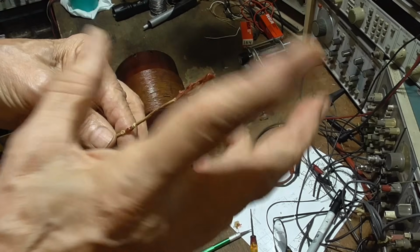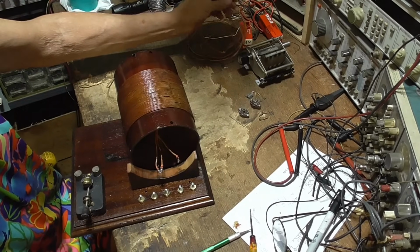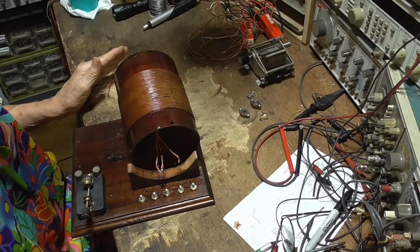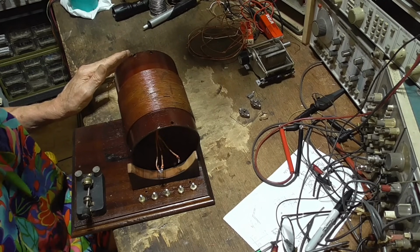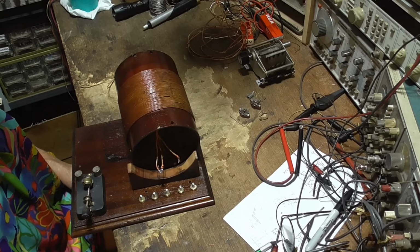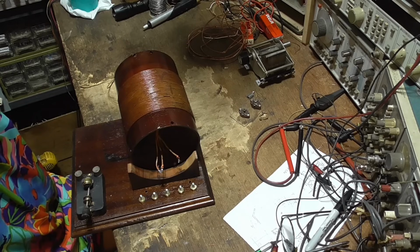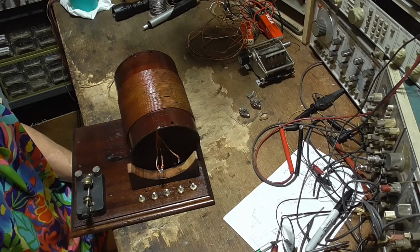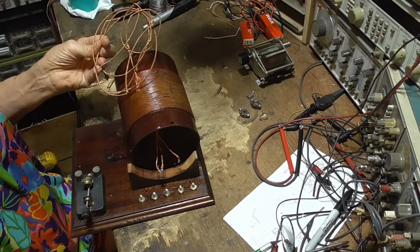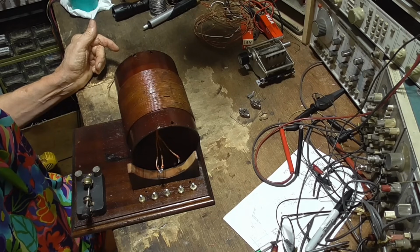There's a certain theoretical problem with that, which makes it so that Litz wire is not that much better than solid wire, at least at most frequencies. You've got a range from about 50 kilohertz up to 500 kilohertz where Litz wire gives you a noticeable improvement in the Q. However, when you get above 500 kilohertz, you start losing the advantage, and when you get below 50 kilohertz, you start losing the advantage. That's because the wire has an internal resistance that makes up for the spreading effect of the strands.